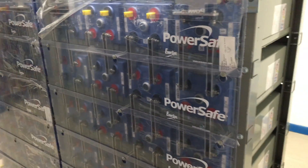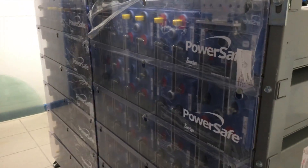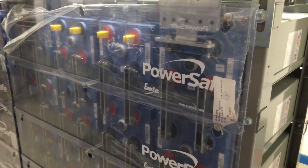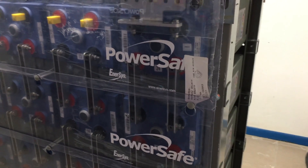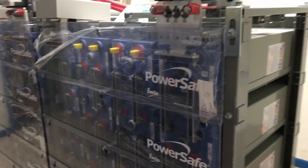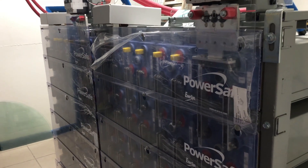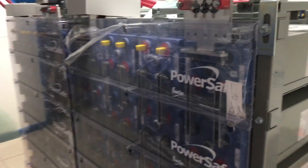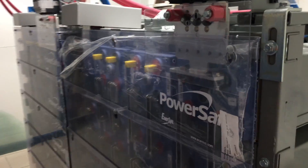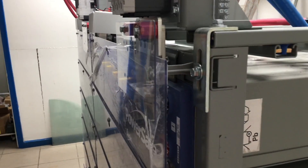If you're going to use this battery bank to deliver 200 amps at any one given time out of each bank, you can last for about roughly 20 hours — 20 hours delivering a constant 200 amps. Out of that 192 kilowatt hours, you're probably only going to get half out of it, so about 96 kilowatt hours, because you're only discharging at about 50% of the capacity.